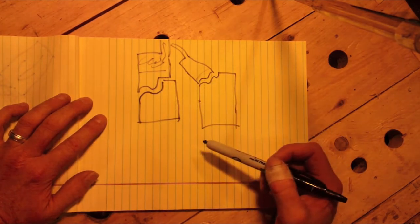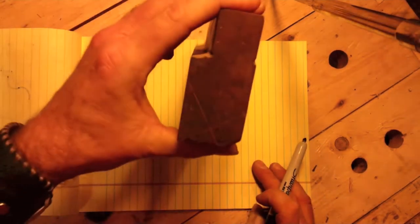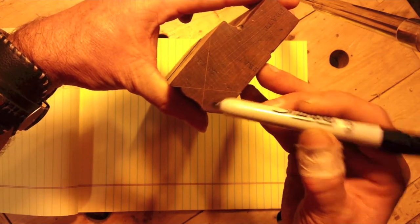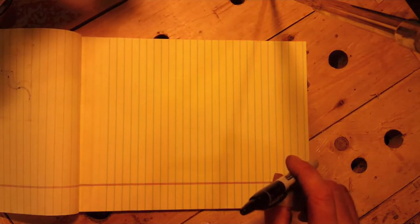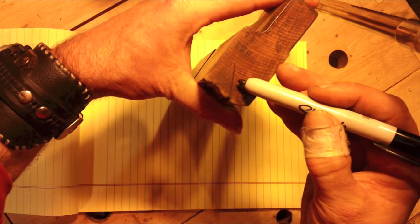It's less steel and it's easier to use. The only problem is you have to pay attention to the front of the plane. And if you can see, right here, we have the sprung line. So we align that piece up with our work piece, and we make the molding. Sprung planes — a little bit different creature.